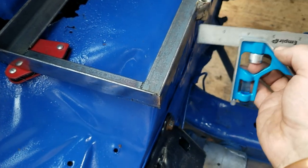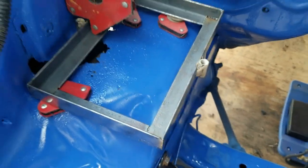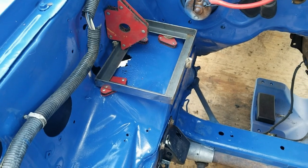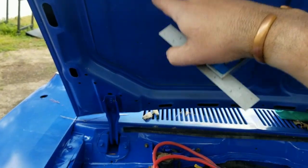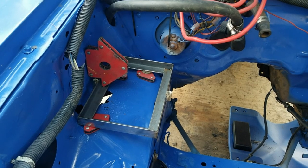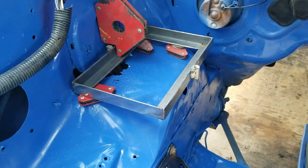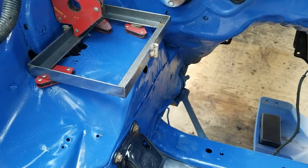I think it's going to hit a little bit here. I measured the battery — I've got about nine and a half inches to the level here and it needs all of that without shorting out on the hood. If you put the battery terminals on this side it wouldn't be so bad, but I think we might have to shelf this project until we get the engine in, because we may have to cut that fender.